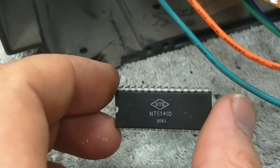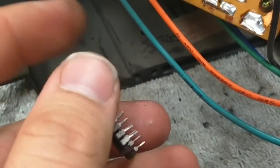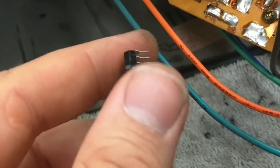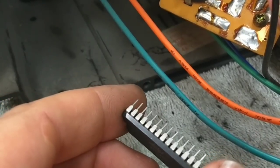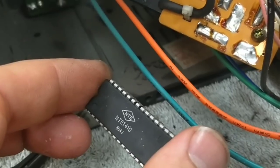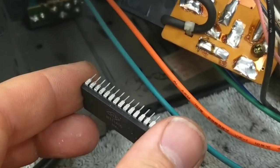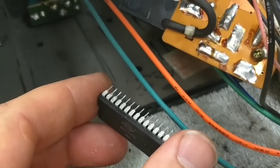So here's the new guy. It's important when you've got a part that's been sitting for a long time — this one's been sitting in a bag for a long time — the leads are kind of oxidized. So I'm going to scrape these before I install the chip. That way we'll have a nice clean connection that the solder will stick to very quickly and I don't have to worry about burning this up. I'm going to scrape these with an X-Acto and make sure they're nice and shiny, oxide-free.